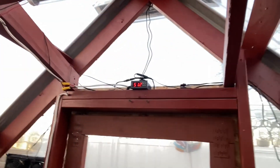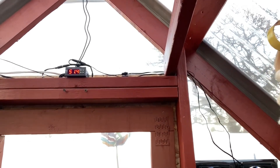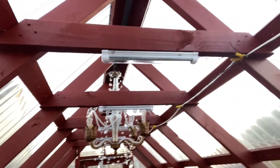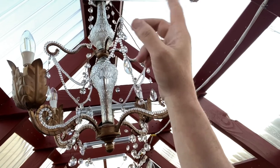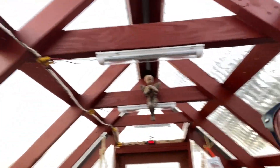We'll go over some of the things you need. The only problem with this setup is these fans aren't currently running on the solar — they're actually running off a 12-volt power source wired into the greenhouse. I also have some LED lights and a little chandelier with 12-volt lights. These are very low wattage, four watts, low amperage — about 0.4 or 0.5 amps each. I've got eight of them wired up and she can just turn on however many she needs. There's also a switch for the little chandelier.